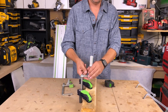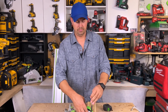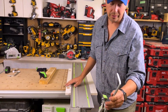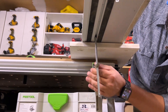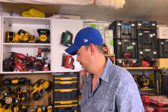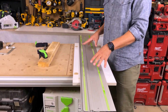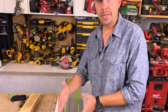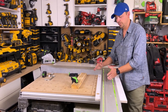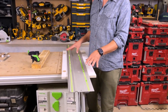You can also use this to hold down like this — screw it down. It works great, but it's just not my preferred clamp; it just takes too long. And why use this when you can use these? If you want to attach your track down to a piece of material, it's super easy — you just take your clamp, slide it down, slide this up to your material, and lock it in place. Now your track is locked on and you can throw another clamp on the other end. Pretty much all the time I'm cutting with a track saw, I am not using a clamp. The only time I'm using a clamp is when I'm using my router, because the router has a sideways push with the bit turning — so you really want to make sure you're clamped down. The pads on the bottom of the track stick so well to the material that it really doesn't move, so I rarely clamp my tracks down to my wood.